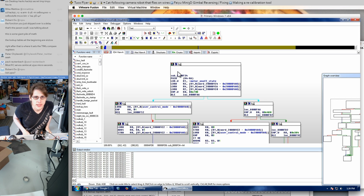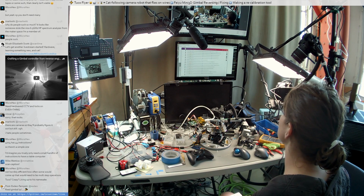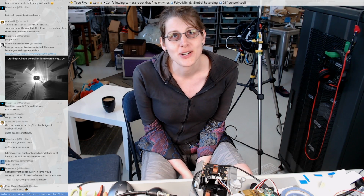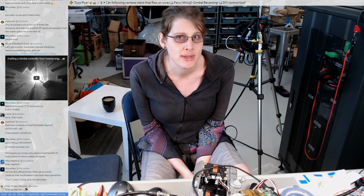So just to bring this back up to a slightly higher level discussion, what I'm trying to do right now is, I know how to calibrate the gimbal at this point, roughly. The next step is how do I control it? I've seen this command 1, which I can send, and I can get the first micro to reproduce to the next one. But I'm trying to figure out basically how the input path between joystick and internal state works, and which pieces of that I need to provide on my own when I boot the micro up in serial connection mode. So one open question still is, are we going to need to patch the firmware? The biggest reason I think to maybe patch the firmware is to get this thing to always come up in the mode where it's listening for serial commands.